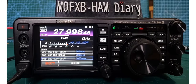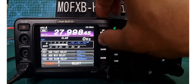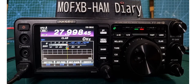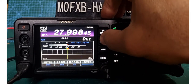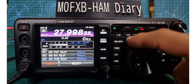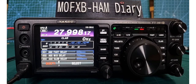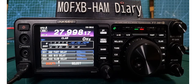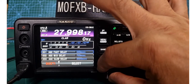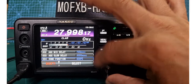Let's have a quick look at the 150 menu items on the FT-991A. I can't tell you I know what every one does, but we can go through and have a look. Hit the menu button — there we go. We'll start at number one and use the multi knob to go up and down. Number one is AGC fast delay — you're basically changing the parameters of the settings on the knobs and buttons.